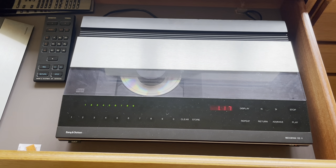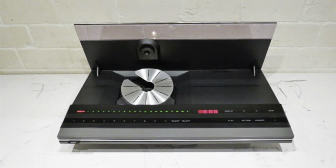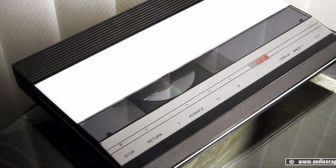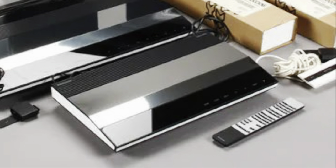The CDX is a very warm, relaxing player. I'm not sure if that's because it's 14-bit — so generally everything is ever so slightly more compressed in dynamic range compared to more modern CD players. The CDX got replaced with the CDX2, externally very similar but now utilising 16 bits instead of 14, with a different laser which has some reliability problems. After the CDX2 came the CD3300, which I believe is very similar internally to the CDX2. The very last of the top loaders ran from 1988 to 1994 as part of a B&O system — the B&O Grand 3500 and 4500 — essentially identical inside, just with a different colour finish, being a CD section out of a B&O Center 9000, based on a CDM4.